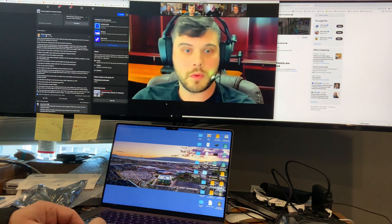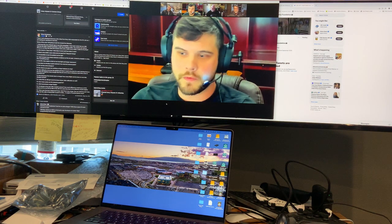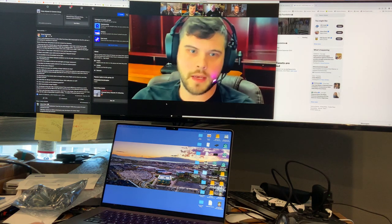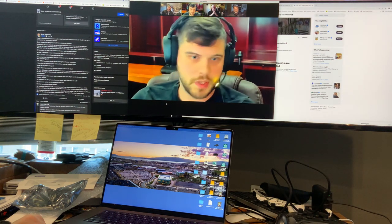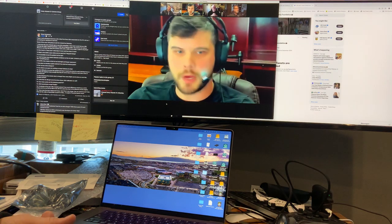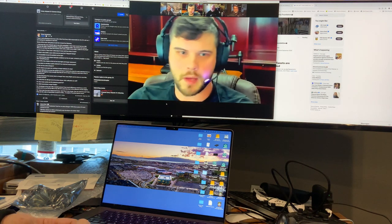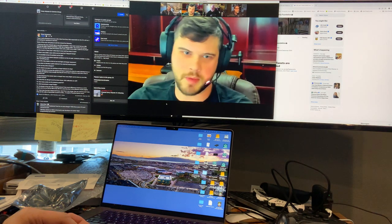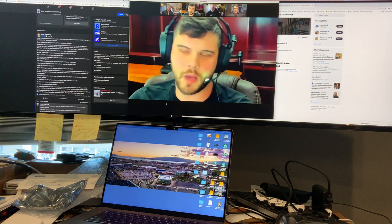So, back to the flight time. You have a 5.5 pound max payload with this aircraft, and one thing I've noticed is the flight time at 5.5 pounds is around 10 to 10.5 minutes, and with any less you gain seconds to a couple of minutes, depending on how aggressively you're flying, depending on altitude, and all sorts of different factors. But the Airpeak is just a little bit bigger than an Inspire, carrying a full-frame mirrorless camera at a 5.5 pound max payload. If you put that on an Inspire, it probably wouldn't fly for 10.5 minutes. Probably not. That's why the flight time is the way it is. It's because of the wheelbase.